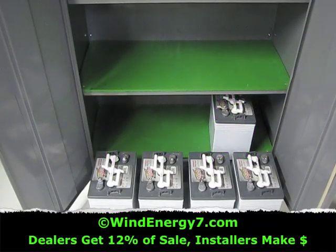Here I've got my battery cabinet reinforced in place and I'm starting to assemble the batteries and do the cabling. Usually I'll lay these batteries out like this and space them out to get an idea of exact cable lengths, because I'm going to have those cables cut exactly for the right length so I've got a really nice clean installation. I'll lay this thing out, figure out what's going where, and get ready to cut my cable length specific to what's needed.